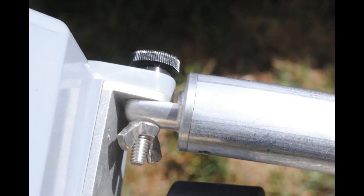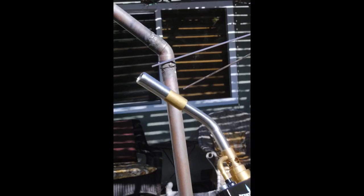So the loop at each end of this particular circuit goes to a series capacitor, transformer coupled, and the unshielded coupling loop, that's the one that we put the coax into, is ready to roll. And Jim is here. Jim, how about telling us what you do on your homebrew loop out of copper to make sure that each and every one of those octagonal joints is not going to have high resistance?